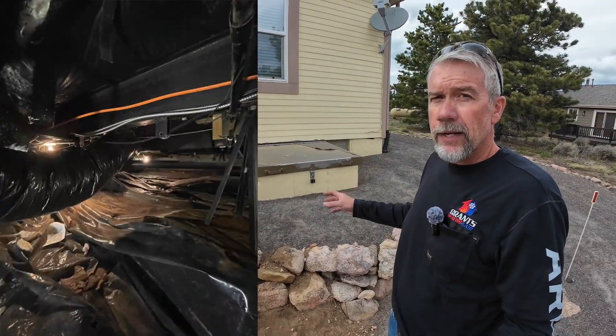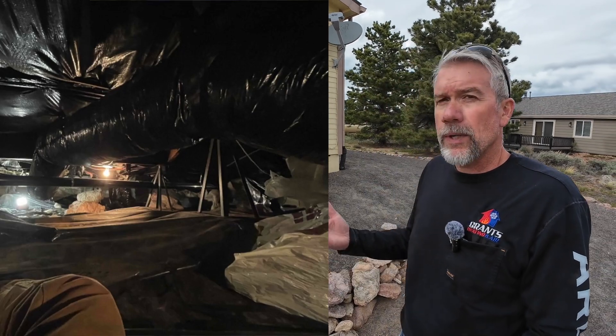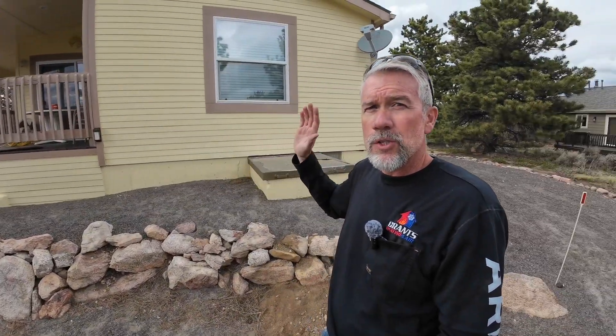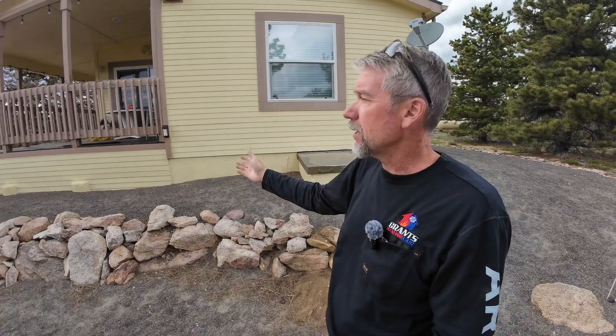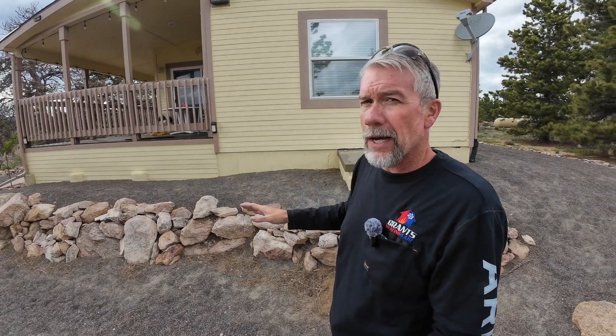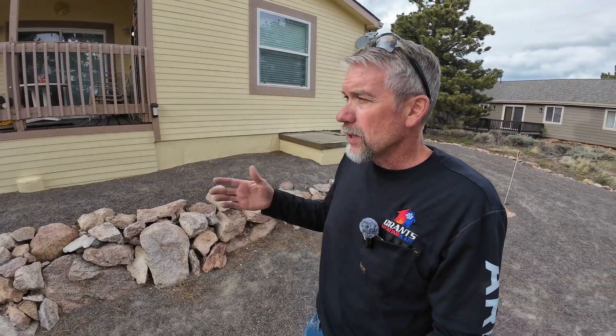I'll show some pictures of this crawl space. We did need to go down there and install a 10-inch flex right underneath the air handler. This is a double-wide unit, so it is going to have two trunk lines going down it, one in the middle of each unit. When you have your air handler on one side, you have to distribute that air to the other trunk line. We weren't able to find how they were doing that properly, so we added a 10-inch flex directly under the air handler and brought it up to the other trunk line in the center. You really need that to disperse the air, get the pressure out, and properly pressurize each of the trunk lines.